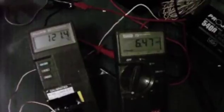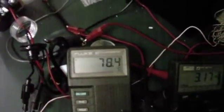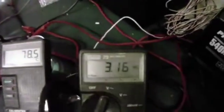We've now fitted the light with 35-watt Xenon HID — you can see by the label there it's 35-watt. It's a hell of a lot brighter than the halogen ever was, and the radiant temperature is a lot cooler. Let's have a look at what it's measuring — she's around about 78 degrees centigrade, as opposed to 120 from the halogen, and she's only pulling 3.1 amps.